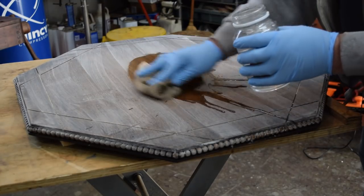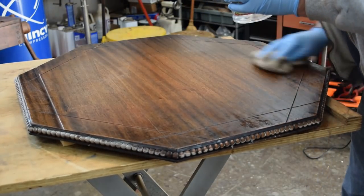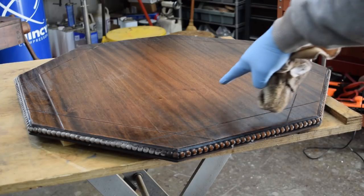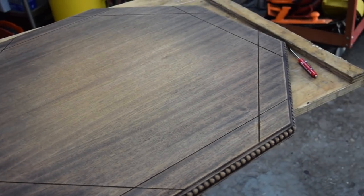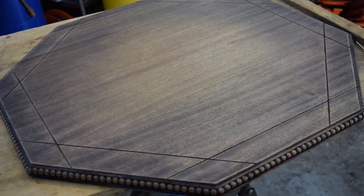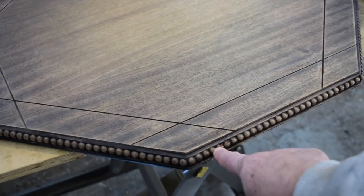She's all dried off — I set her out in the sun. Let's rinse it off and see how it came out. Still have a ghost of one right there. We brought it back inside and you can see we've got most of those rings that have either disappeared or lightened. We'll see how they respond when we go to put color back on it. I also took some time with a container of water and a toothbrush to make sure I brushed any oxalic that had dried in these little crevices.